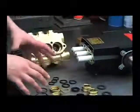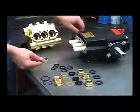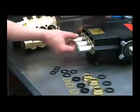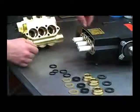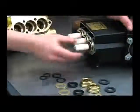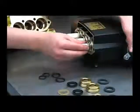The rest of these packings and retainers we'll put on to the plungers before we put the head on. Take these retainers and put the outer o-ring on them, slide those on, and put oil on that o-ring. Then put these seal rings and o-rings into the retainers — put some oil on the seal ring, push that over the plunger, put oil on this o-ring, then take this washer and put it on, pushing that o-ring over the seal ring until the washer bottoms out.